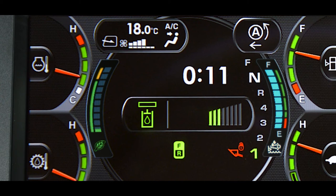One major addition to the monitor display for Tier 4 Final is the diesel exhaust fluid, or DEF, level gauge, located on the right side of the monitor. The DEF level gauge indicates the remaining level of DEF solution in the tank and has four indicators. The blue squares indicate the current DEF level. The DEF level tank condition indicator is a white icon on a black background when systems are normal. The DEF level operating range indicator has a green section and a red section; when the blue level indicator squares reach the red section, this is considered the critical refill range.